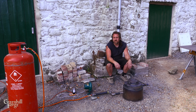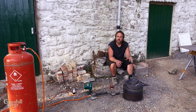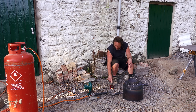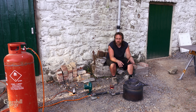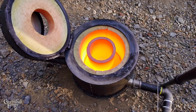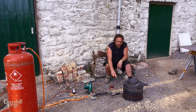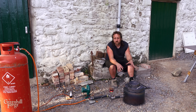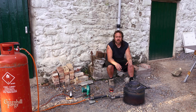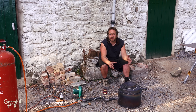Here it is at four PSI — the roar got a lot louder and temps are already climbing. After about another hour at around three and a half PSI it's at 1,170°C (2,136°F). This thing is screaming hot — it's getting close to the temperatures needed to do cast iron, so with a little tweaking I might one day be able to try that. Even at this higher temperature with increased airflow, the exterior is even cooler to the touch. This build turned out great. The refractory cement should be just about cured, so I'm going to do a slow cool down over a couple of hours. I'll be back soon with the next video going through the full process of turning cans into fresh aluminum to mill down for parts.